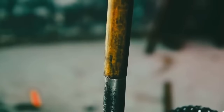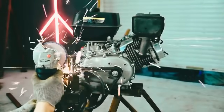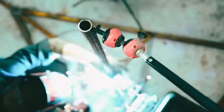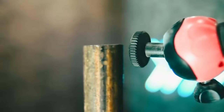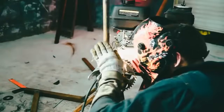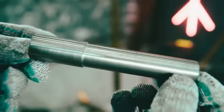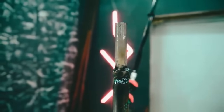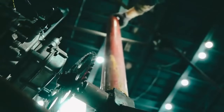We have to sharpen the reduction gear shaft a bit so the pipe could tightly fit it. We are gradually welding and straightening using a tripod. On the top of the pipe there will be an adapter rod. Further we put a casing from the pipe on the elongated shaft and place the house bearing on top.